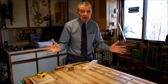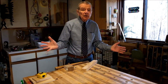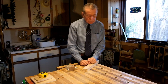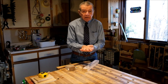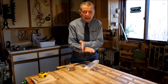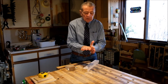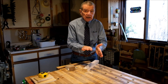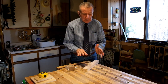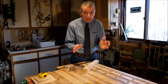So the last little bit of the puzzle is to figure out exactly what order to put them in, in order to get step-by-step increments all the way through. Here's my answer: start with five panels in the middle, each one-half inch thick. At one end, put one one-eighth inch panel. At the other end, put a quarter-inch panel first, and then an eighth of an inch on the outside. So let's say you want a few different measurements — I'll step through from one inch to one and a half inches in eighth-of-an-inch steps.